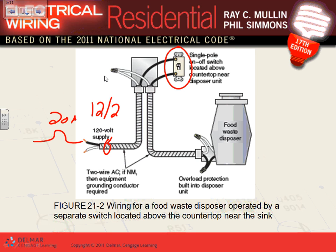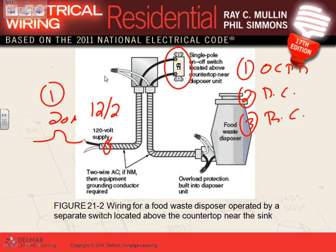When you have appliances, pay attention to three things: number one, overcurrent protection device; number two, disconnect; number three, branch circuit. Like motors — one, two, three: overcurrent protection device, disconnect, branch circuit.